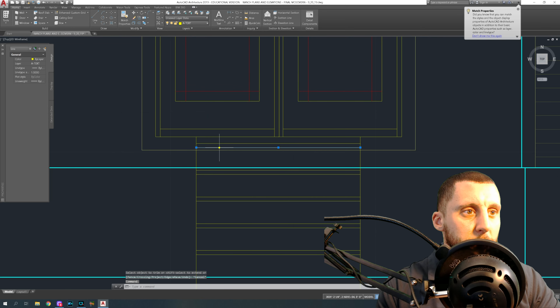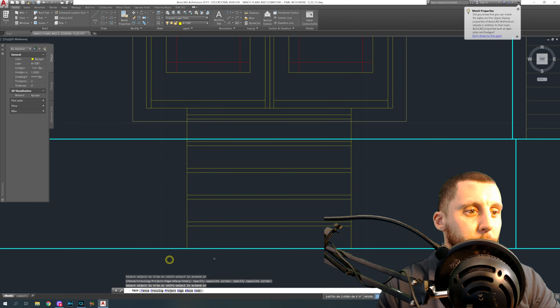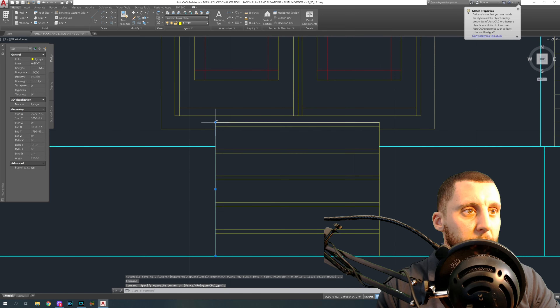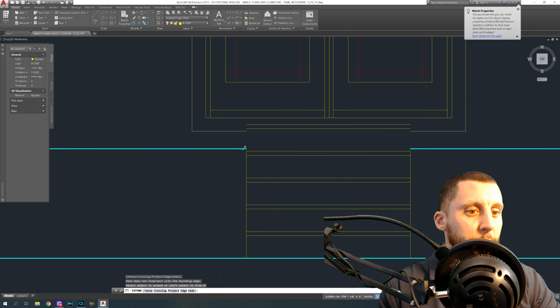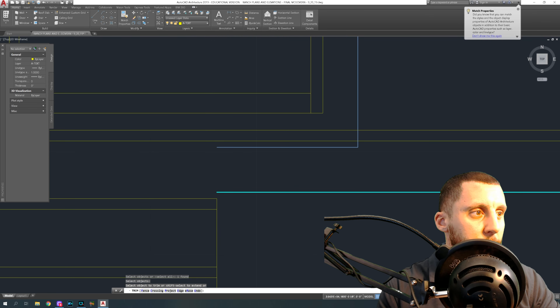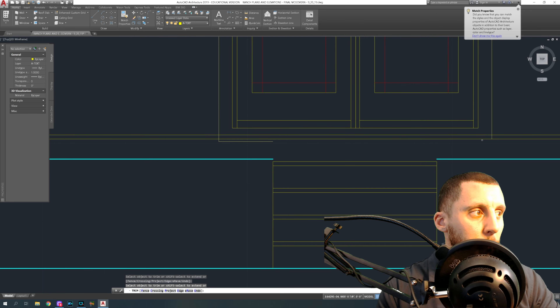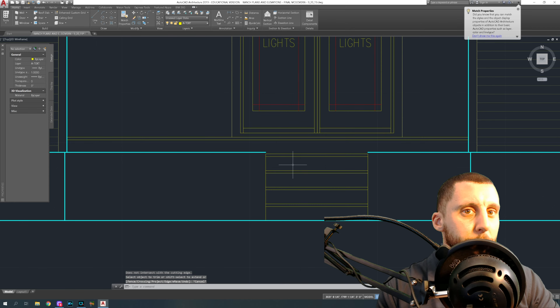This one is going to be the top of the deck. Trim here, one, two, three, four, and then the next one is the top of the deck — trim there, trim there, trim that out, trim that out. There'll be more trimming later for the door, but don't worry about that now. This line can be stretched back to here for now, and we'll figure out where it goes later. Do a quick extend — EX Enter Enter — and stretch that all the way in that area. Then a quick trim to clean up.